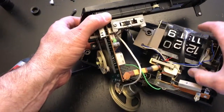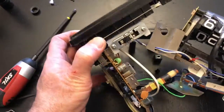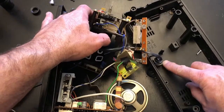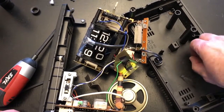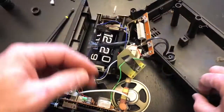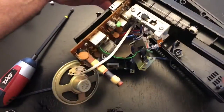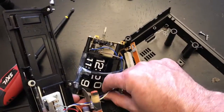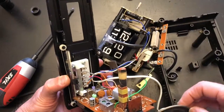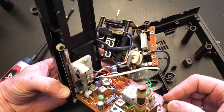The clock mechanism also comes out by taking your time and working it out. You'll see we're still attached to the bottom of the cabinet — that's the cord holder, and you really can't get the cord out of the base without desoldering it from the power rail. So I've decided to desolder the wires and replace everything with the good parts from clock number two, keeping the speaker with that board so I don't have to mess with the tuner.